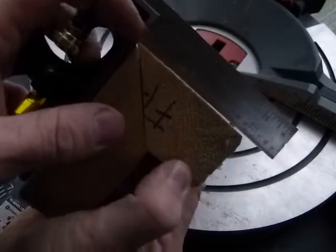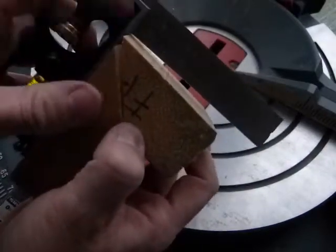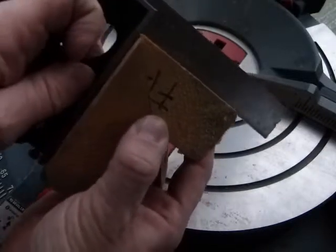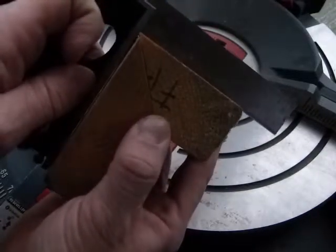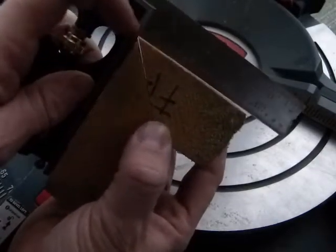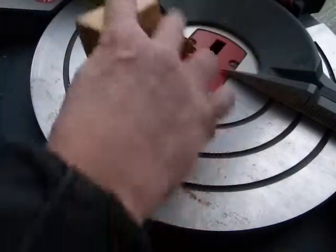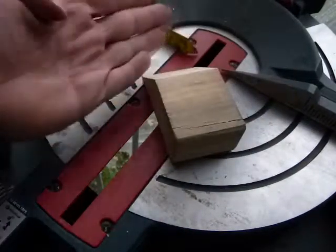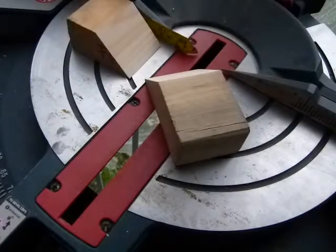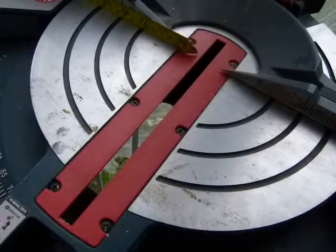between the two wood blocks. There's no gap here where my thumb is holding the wood there, but if I make these two pieces of wood tight against both the stock and the blade of the square, there is a gap here and you can see light coming through it. Consequently, my bevel stop for the left 45-degree angle is incorrect. It needs adjustment.